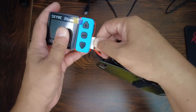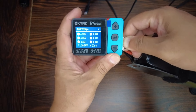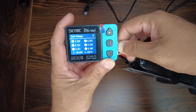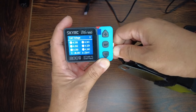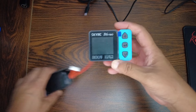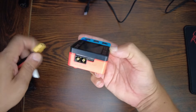I'm plugging a 6S battery into the power port — and there you are. Very quietly it shows each cell at 4.3 volts. It's a high-voltage battery I charged to 4.35 volts, and it's showing all the other information as well. That's how you use it as a battery voltmeter.